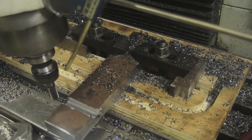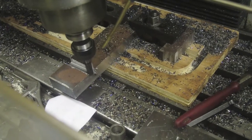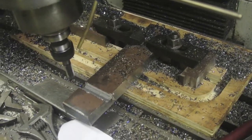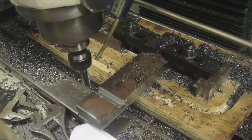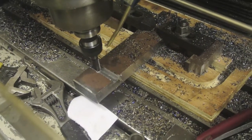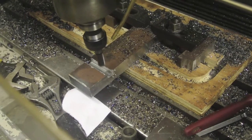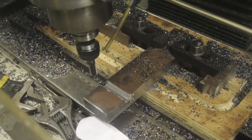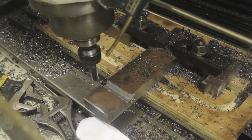Just finishing with one of the last of the plates that I need to make up my gang tooling assembly. Once this is cut I will dress it off — rag it, as we used to call it when I was an apprentice fitter — get all the burrs off it. I'll trial assemble everything onto the mill itself, and then weld in situ so that everything is nicely positioned. I'll then return it to the machine to finish it off, to ensure it's nice and true and square. I'll try and get some video of it assembled underneath the mill.